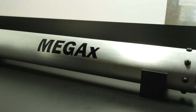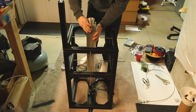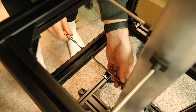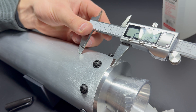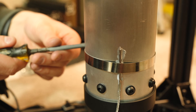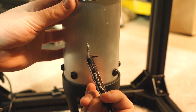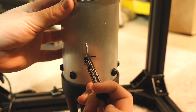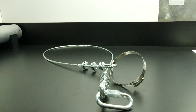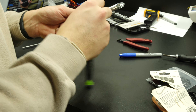Once the motor was fully assembled, the next step is integrating it into the test stand. I start by seating the motor into the motor adapter, then tightening down all eight alignment pins — these make sure the motor stays perfectly aligned during the test. After that, I install three thermocouples at specific locations on the casing to collect temperature data on the outside of the motor, which helps me learn about how reusable this design may be. To improve heat transfer, I'm using thermal paste between the casing and thermocouples, then securing them in place with pipe clamps. I also put together a metal braided rope to act as a leash, just in case this motor ends up going rogue. I bought a piece of metal rope, and on both ends added a thimble and saddles to make a nice, strong loop — one side connects to the blast chamber wall, and the other side connects to the motor.